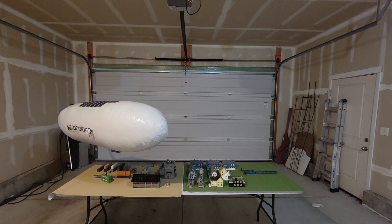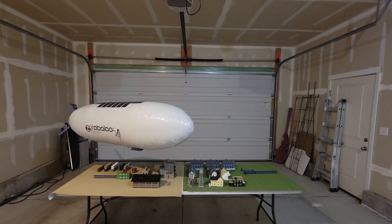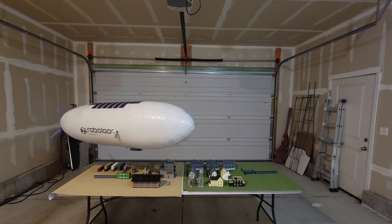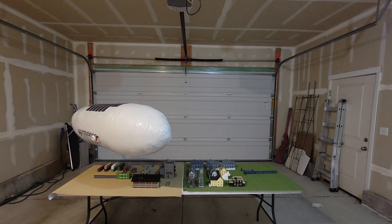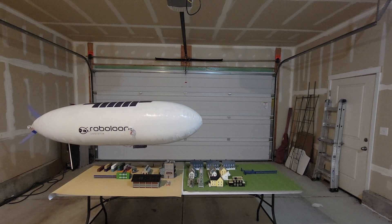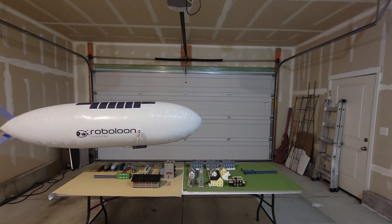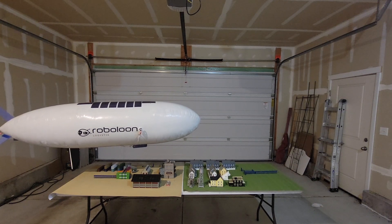The point is, all you have to do is get the blimp to land somewhere near the blue guide, push up against it, and then move forward until click. What happens is there are two little magnets in the shipping containers and they attach to a little post at the end. So now the airship is locked in place — it doesn't really go anywhere, it's locked in place. The key — which is what the paper was titled: cargo sling load operations — is that the airship is always secured to either one load or the other, so at no time is the airship in danger of floating away.